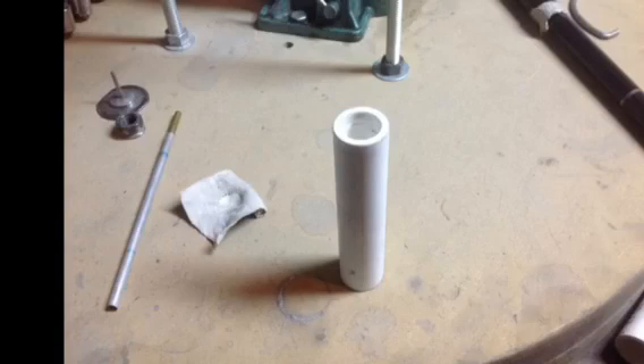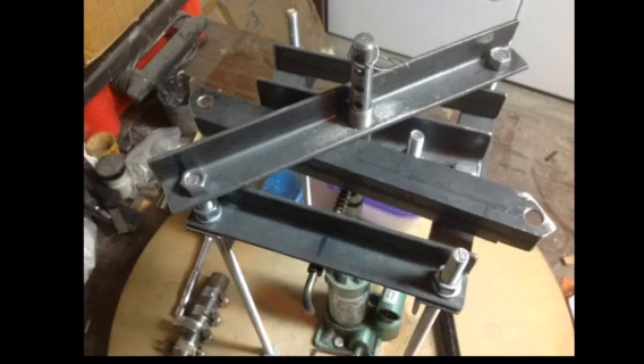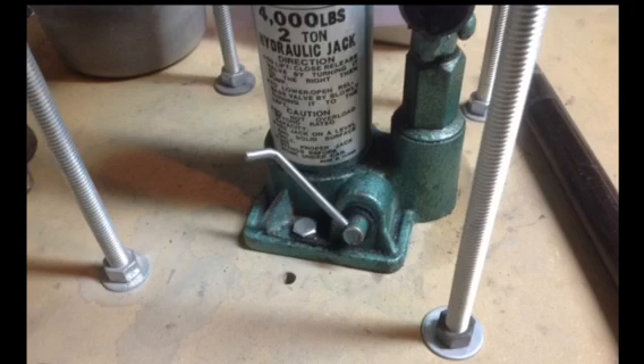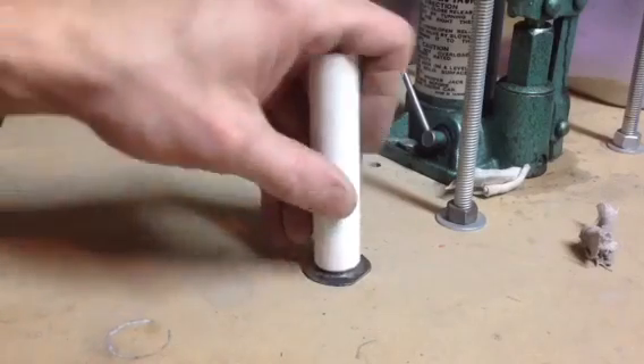On the left is a gauge for measuring how far the pintle goes up inside past the nozzle. This is a two-ton hydraulic press I made using a bottle jack, 3/8-inch all-thread for the four corners, and some angle iron for the top. The piston on the top is fixed with a cross-pin to hold it in place, and the jack pushes up as I pump. I've added a rod to the release mechanism so I can release and lock the vise. Throat diameter on these nozzles is 0.10 inches for a KN ratio of about 40, and the burn rate I'm getting at that is about half an inch per second.